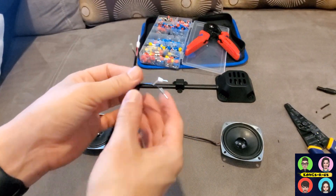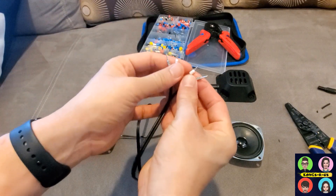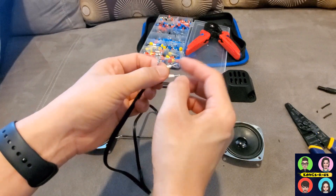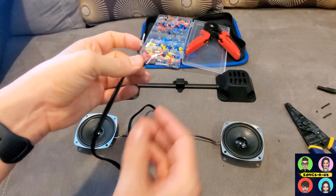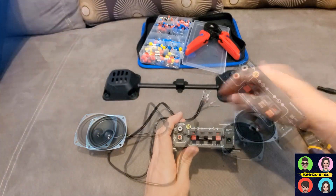As mentioned, you don't need to add ferrule crimping tubes — I just like to do this, and if you already bought the set, might as well use it. This creates a better, more secure connection when you plug it into your amp. As long as you have a wire input terminal to plug a piece like this into, it makes it a lot more secure. Otherwise, you can just expose wire and plug it directly into your amp as well.